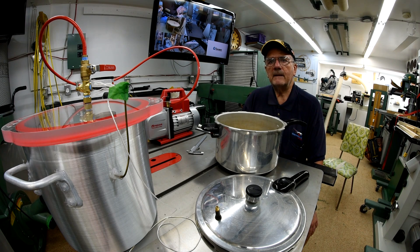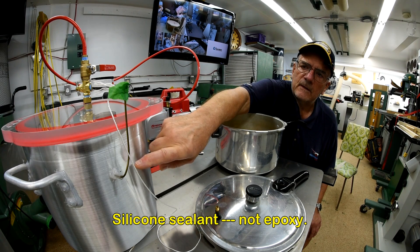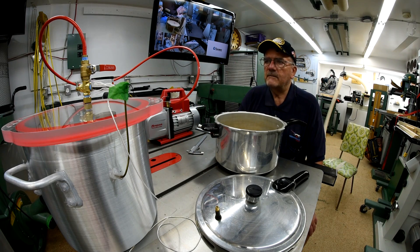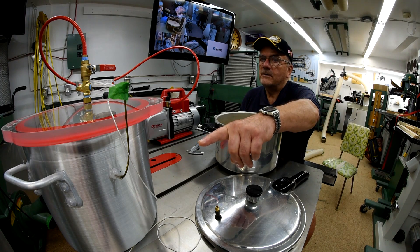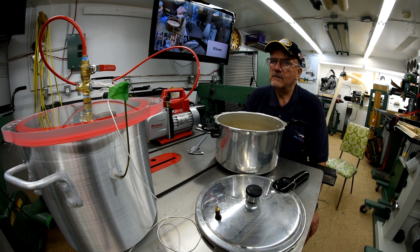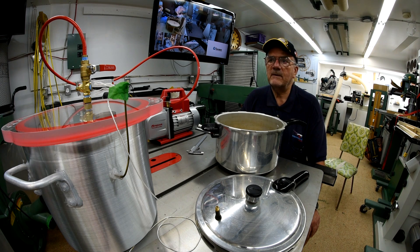It's the next morning and I went ahead and infused a little piece of wood pretty much the way you saw in video number two. But before I did that, I put epoxy sealant on the joints and around the handle. When I first got this vacuum chamber I tried it out right away and it wouldn't hold vacuum well — it would slowly leak in, and that was before I drilled the holes. So I'm just eliminating all the possibilities; that's why I put sealant around the handles and around the rivets.